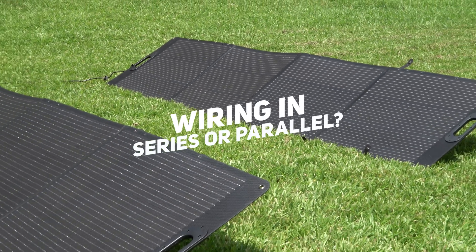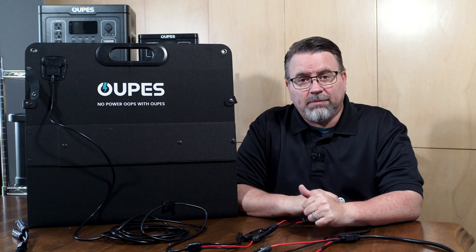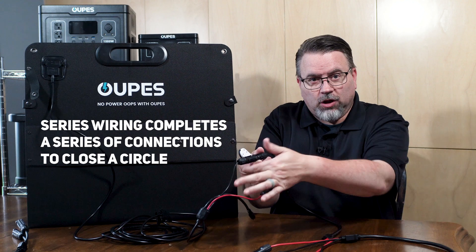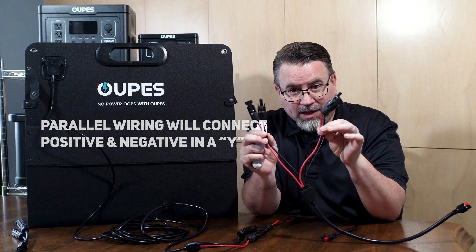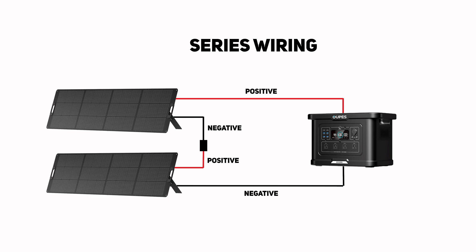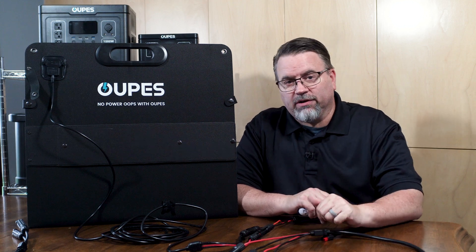How do you connect your panels in the most efficient way? There are two ways to connect solar panels, and what you use depends on several factors. You can connect your panels in series or in parallel. Think of series as completing a series of connections in order to make a closed circle. For series, you simply connect one side of the panel to the input of the solar generator, then connect the other to the output of the other panel, and connect the remaining output to the open input of the solar generator, closing up the series. You can connect a string of panels together, adding as many as your generator can handle.